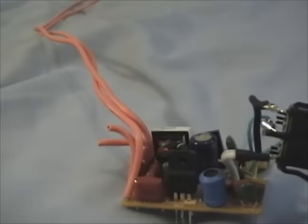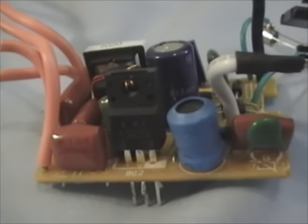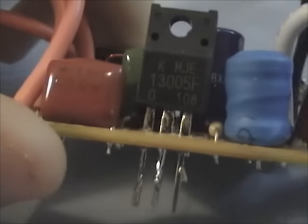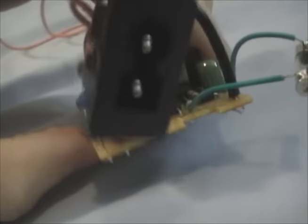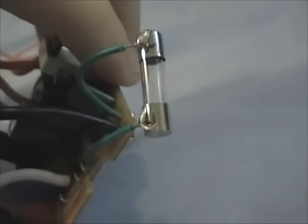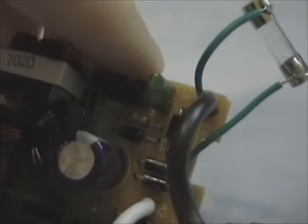We're back. The surgery was successful but not without a couple of mishaps. Here's the new transistor in place. There was really confusing information on the internet about which leg of the old transistor was the base and which was the emitter, so I had to test it a couple of times. I think I've soldered it on the right way - if I haven't we'll sure as hell know when I plug it in. The power plug - I desoldered the wire that originally went to the switch and directly soldered the power plug in its place. As you can see I've also soldered on a new fuse.